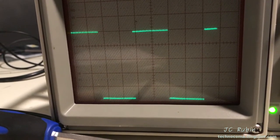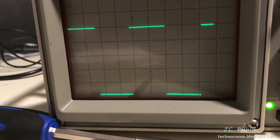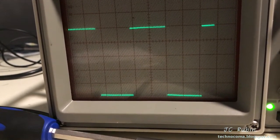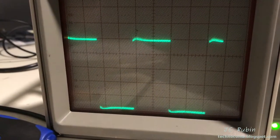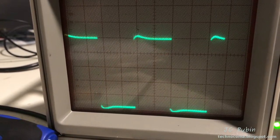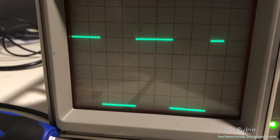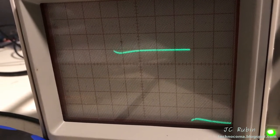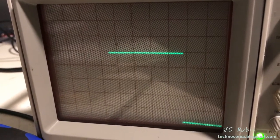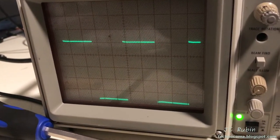This is the resistor, not the capacitor — I'm just displaying how that looks until I get it nice and flat. The edge comes from the capacitor itself. Here's the capacitor — you can see what that does. I find bringing it in to 10 microseconds makes it even easier because you can see it even better. There's an example right there that doesn't look too bad — I'm going to call it right there and move on.